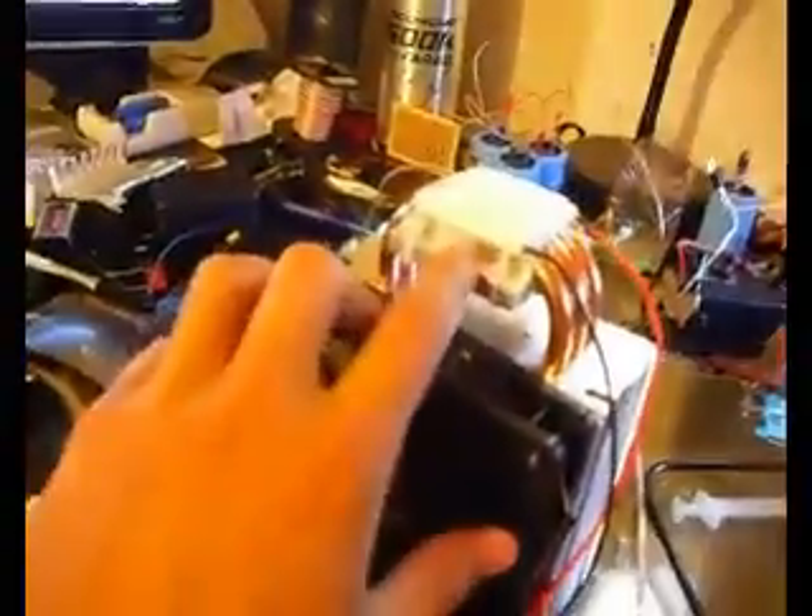I'm using the yellow and black cable because the yellow cable is 12 volts at 4 amps, which is 48 watts. This is a 168-watt Peltier, so it's being underdriven, but it still works.